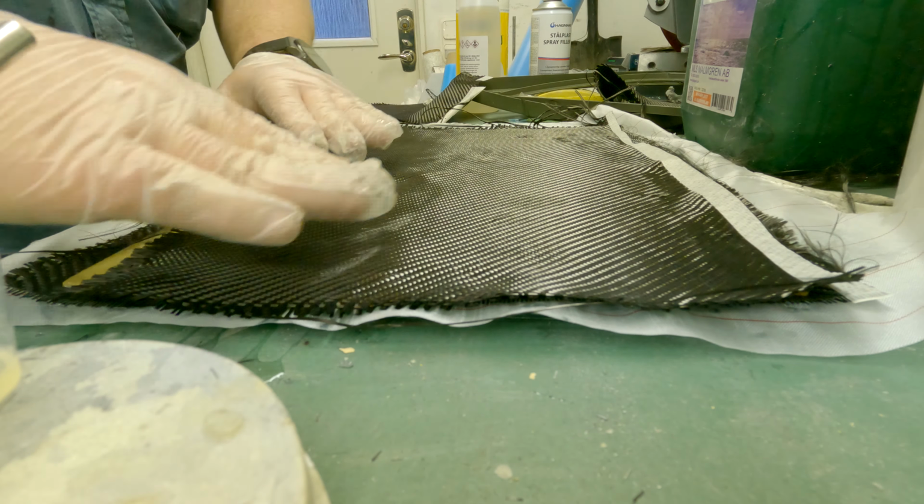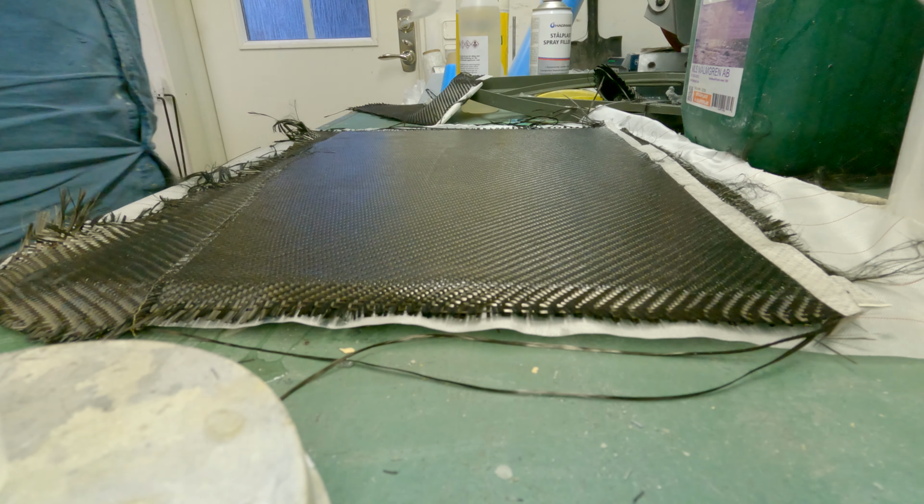There will be additional carbon when you laminate it into the hull, so you get a little bit free there. This ain't Koenigsegg carbon work, that's for sure, but it's Lars Lindqvist carbon work, and it's gonna have to do for me. Probably won't use this, but the extra pieces I can always find use for, I can do other little things with. We're gonna put another layer of peel ply.